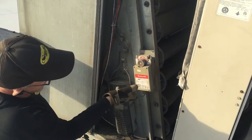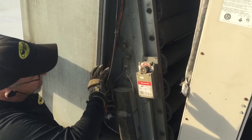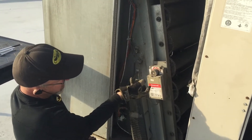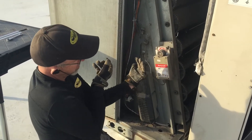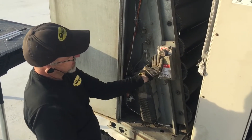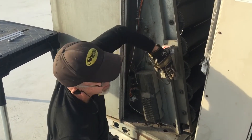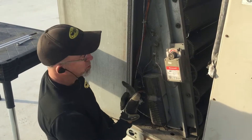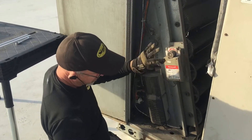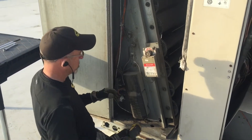So I'm going to take this assembly off. This motor turns clockwise right now, and this blade needs to be driven counterclockwise. So when I take this motor and turn it this way, I also have to flip the motor over. The motor is going to drive the same internal direction, but by flipping the motor over you can make an actuator run backwards, or drive something backwards.